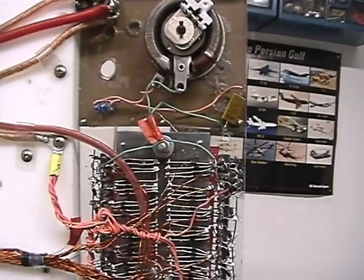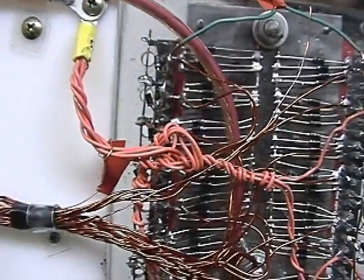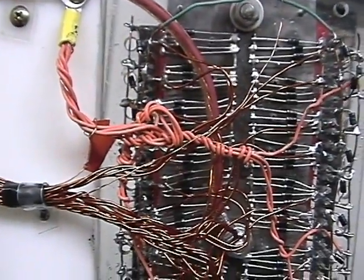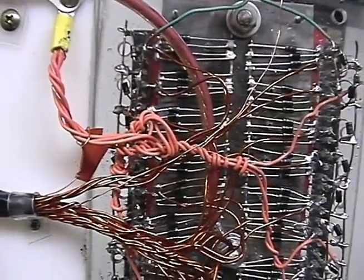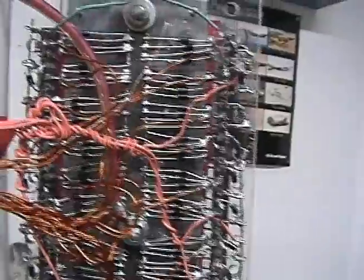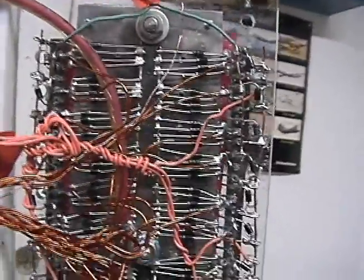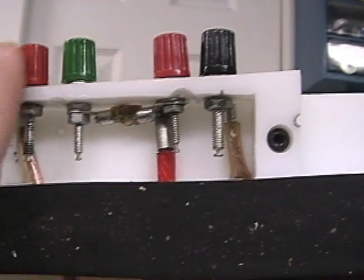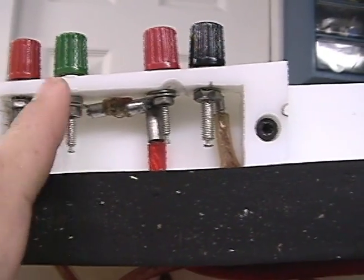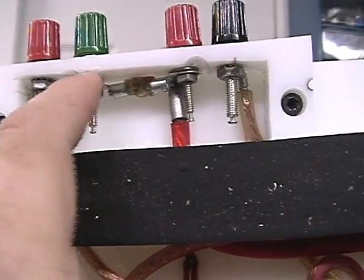I use a 10 ohm fireproof resistor on each trigger circuit, and I use 1N4007 diodes on the output and across the chip — the 1N4007 diode is used there too. So basically it's the same diode throughout the whole motor. Using banana plugs makes it real easy. You can see here this is the negative — that's why it's green — and that positive is tied to the negative and fed back into the circuit for the collapse.